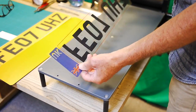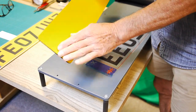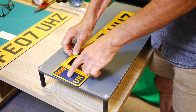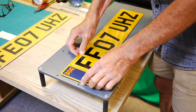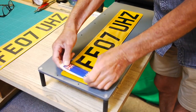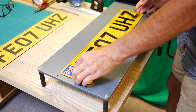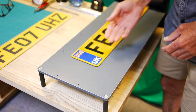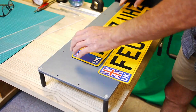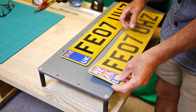When you're printing to two-part ABS reflective and acetate — we've just printed the plate. You can see that it's actually printed in reverse, and the reason for that is it's going to be laid down onto a piece of ABS reflective. So when this goes down onto the plate, you can see what happens to the badge. What we have to do is put a panel behind the badge, just the same as when we did the acrylic, and the badge goes in behind like that.